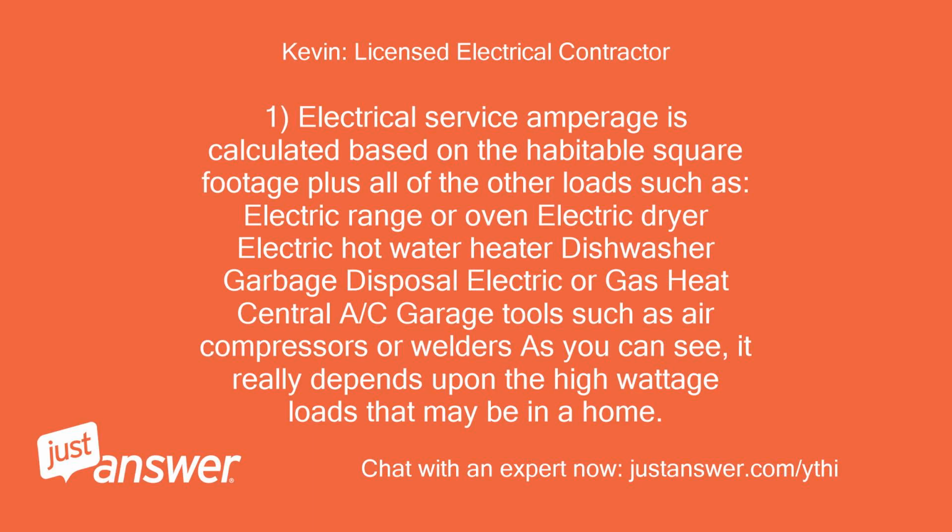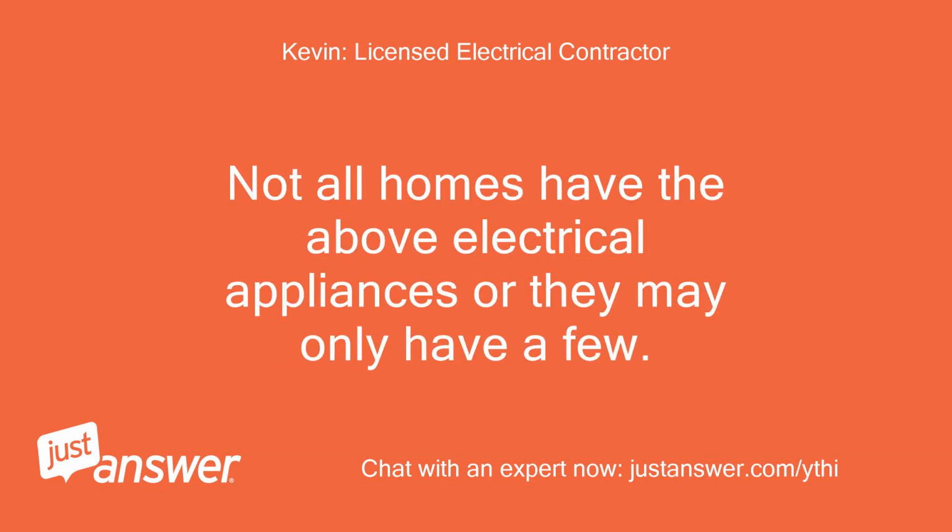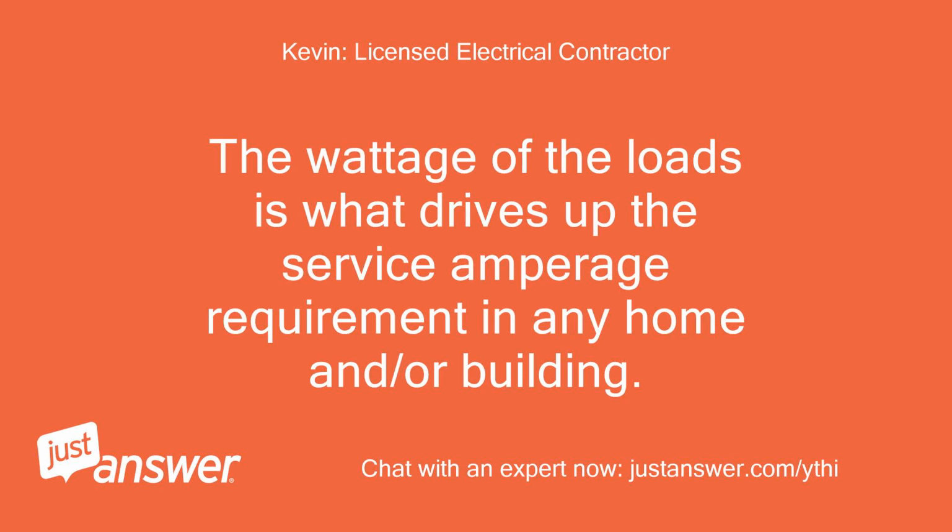Electrical service amperage is calculated based on the habitable square footage plus all of the other loads such as electric range or oven, electric dryer, electric hot water heater, dishwasher, garbage disposal, electric or gas heat, central AC, garage tools such as air compressors or welders. As you can see, it really depends upon the high wattage loads that may be in a home. Not all homes have the above electrical appliances, or they may only have a few. The wattage of the loads is what drives up the service amperage requirement in any home and/or building.